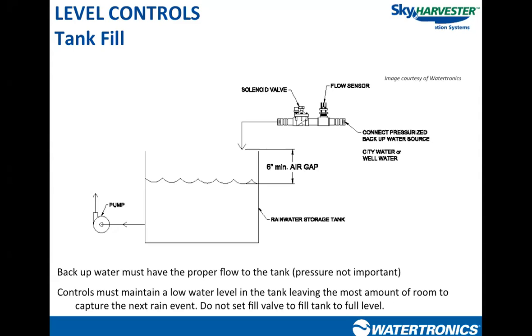Setting up those open and close levels has a drastic effect on the overall success of the rainwater harvesting system. Also ensure the off-level for the city fill valve is set below the overflow invert elevation on your storage tank. If accidentally set higher than the overflow invert elevation, the city valve stays open and water rises in the tank and goes straight out the overflow pipe — a costly mistake.